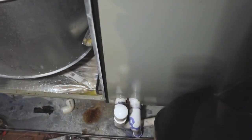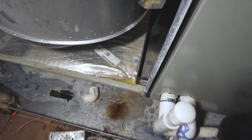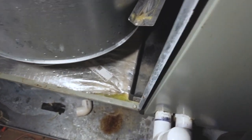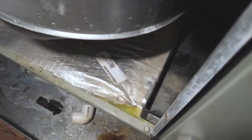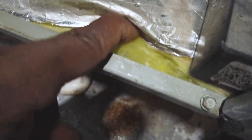So just something to keep in mind when you're looking for leaks. This is a pretty uncommon situation — like one of those one-in-a-million shots. You can see it's supposed to be glued, but the glue just broke free. I'll probably put some silicone on it and try to re-adhere it to the coil here. I'm guessing that's just to keep it from pulling too much water — too much negative pressure pulling that water in — and as you can see it's really saturated over here.